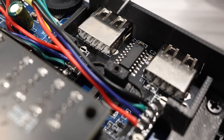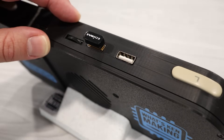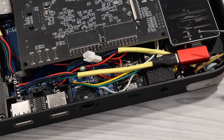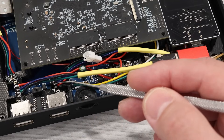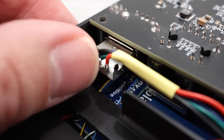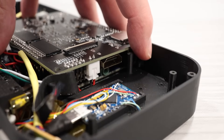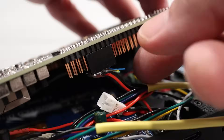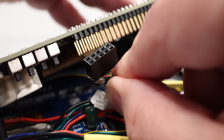This other board is a USB 2.0 hub. There are two USB ports on top, so you can plug in accessories like a WiFi dongle or an external controller. The USB connections for the NFC reader and the built-in controller are hardwired into the USB hub directly. The uplink for this hub is plugged into the USB port on the QM Tech FPGA dev board.